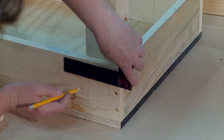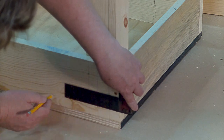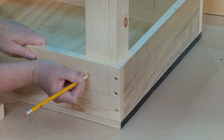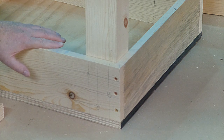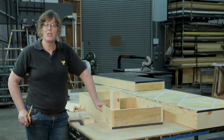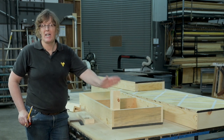So we've got one here, one here, and one there — that's your general screw pattern you want to live with. You don't need to be perfect about it; if you want to make a template you can, to get things a little more consistent. But try to put in three screws in that sort of pattern, and that's going to be your strongest connection, least likely to split out your framing or your leg.